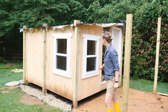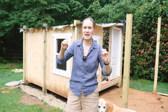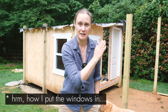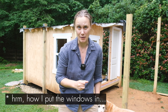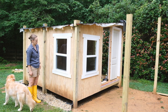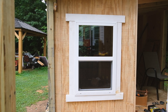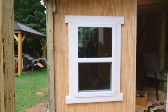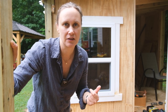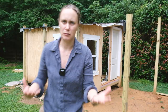The corner angle of windows — the windows have now been put in properly with paper and caulk. I actually have a video of how I put the windows in on my little workshop if you want to see that process. Windows are in and we got some trim around them which really makes them pop. There are two camps for window trim: the mitered corner trim and this one — the craftsman style trim. This is my preferred trim, partly because it's easier and you don't have to get those miters perfectly, but I also really like the look. It looks a little more utilitarian.